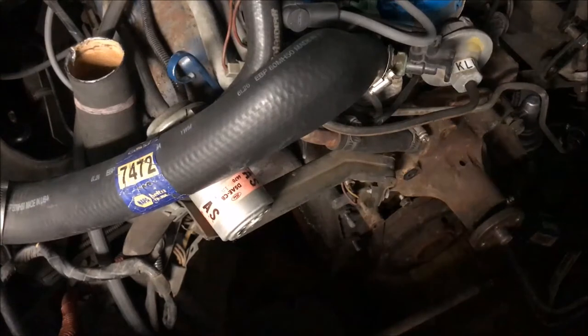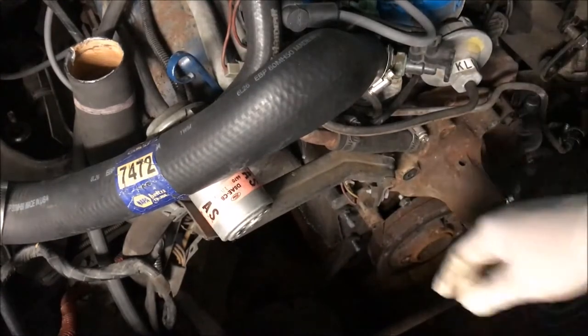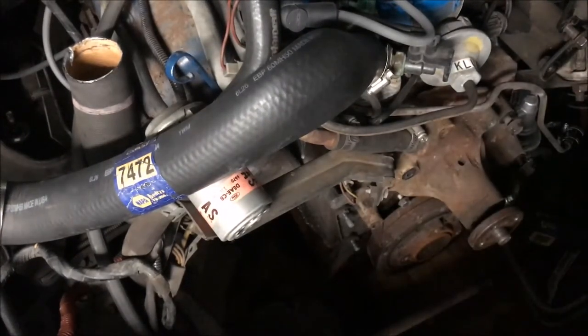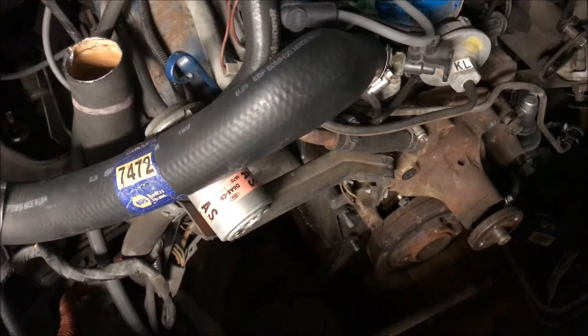I am in shock and awe — I got it off. Even though I could swear the bolt wasn't moving and I was just twisting it and it was slowly falling apart, believe it or not I was moving it and it came out. Turns out there's a nut in the back that I didn't know about that was binding up on there, and that's why it was so tough. If I had known about the nut I probably could have sprayed that back side with penetrating oil and that would have helped.